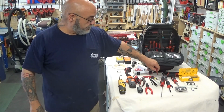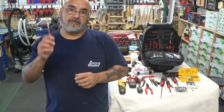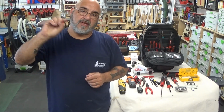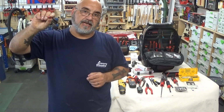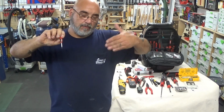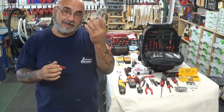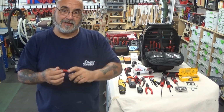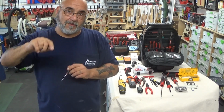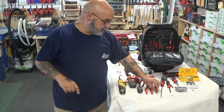A very small screwdriver, and it's stuck already. Now, there's two reasons. One, on the older models, to set the secondary gas pressure on the PC board, you need a small screwdriver to get in to set it, and that we're going to go over in a future video. But also, us as tradesmen have those big fingers, and there's tiny little dip switches in two banks, an upper bank and a lower bank. The small screwdriver helps pop the dip switch over when you have to set the dip switches.